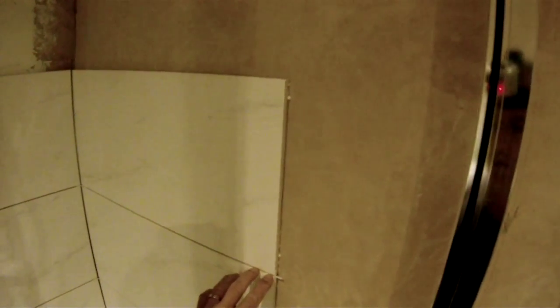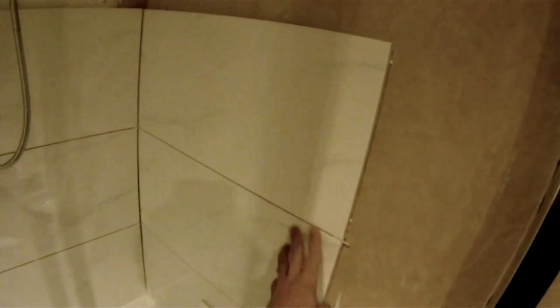I'd always recommend using tile spacers — not using them is a big mistake. The real useful idea is it gives a very consistent gap between the tiles so you get a very square look. Just put the spacer in lightly so you can pick it out once it's dry for a good grout fill later. It's probably a good idea to tile only up to about three or four tiles high to start with, leaving it a while for the glue to set — the weight might otherwise start pushing out the spacers and squashing your gaps.